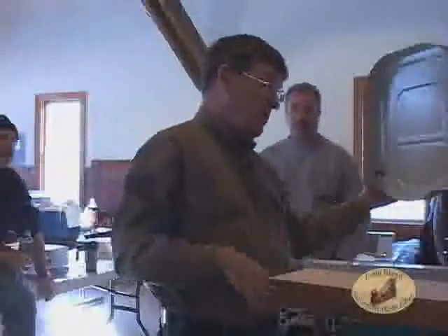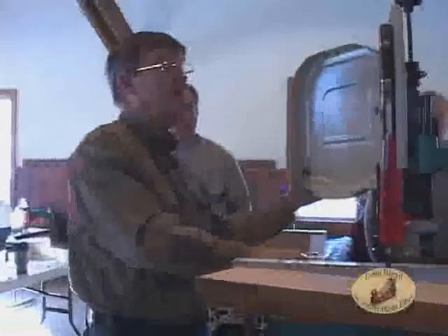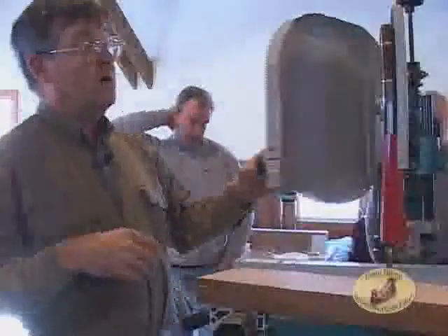When you first buy a saw, the books tell you to check wheel alignment by placing a straightedge on the bottom wheel and seeing if the top wheel lines up. I've seen many saws where wheels were off by an eighth of an inch. We found one at Bob's shop where the top wheel was an eighth of an inch off — we shimmed it out by making a washer on a wood turning lathe. Honestly, I don't see that it ran any better before or after, and I think wheel alignment is probably exaggerated a bit in fourteen-inch bandsaws.